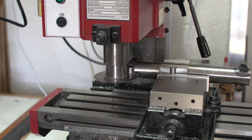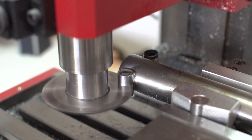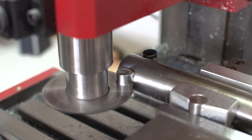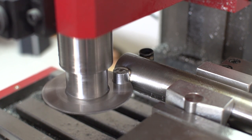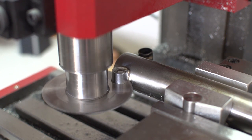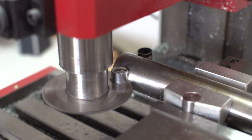It really has everything to do with everything you guys said, which is cutting speed, the proper lubricant, making a conventional cut and not climb cutting, and also cutting a part that is not hardened from the welding process.